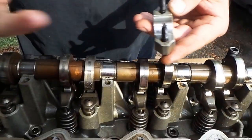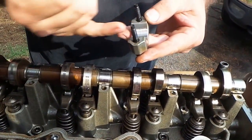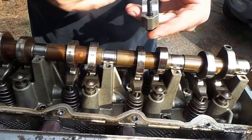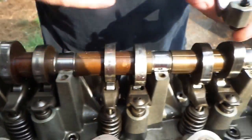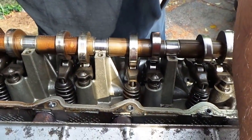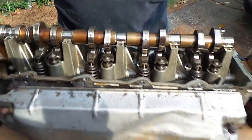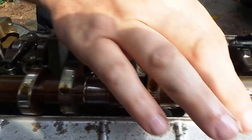Okay, now the first thing you want to take a look at is in here. We're going to use emery cloth to wipe these out, but basically they don't have to be redone. The machine shop says they don't have to be pretty to hold the cam in, so even if you've got some scoring or some marking, the book says to replace it - I call bullshit and say just clean it up and rock and roll. I've never had a problem with it.